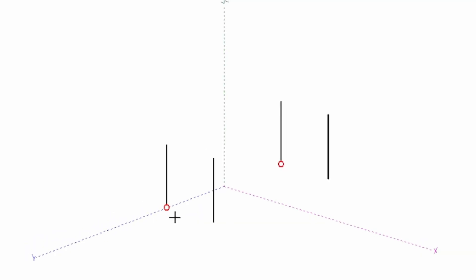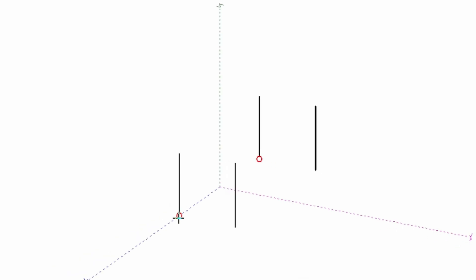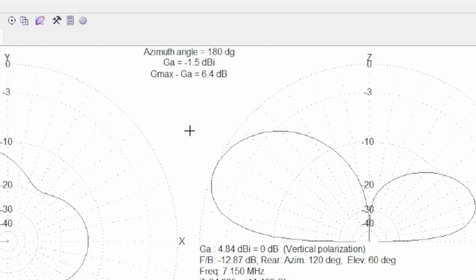Anyway, I'm pleased with that experiment. We'll let it run for two or three more weeks, then we'll build the flame thrower — that's a pair of these separated by 0.55 wavelength, which should give me nearly another 3 dB. I did the math today chatting to John Gendron — it should bring me down from minus 1.5 here to about 1 to 1.5 the other way, giving me another 3 dB again toward the US.